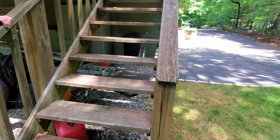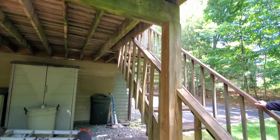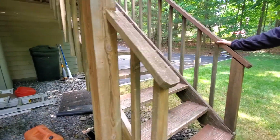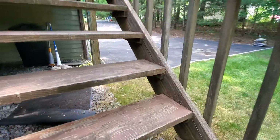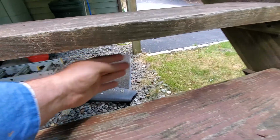Somebody told me you couldn't. One of the guys said I couldn't. Oh, okay. There's so many different things. I'm just familiar with the most obvious ones, but having a riser in the back is not a problem. I like that anyhow because that lends to my idea of having a joist. Instead of a 2x4, we'll use a 2x6 and set it back a little bit, like an inch. And that'll do our support right there. Okay, so that's great.